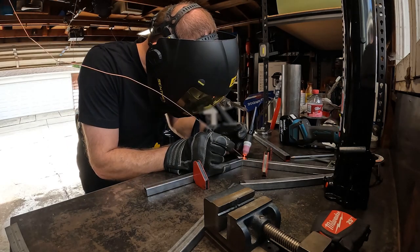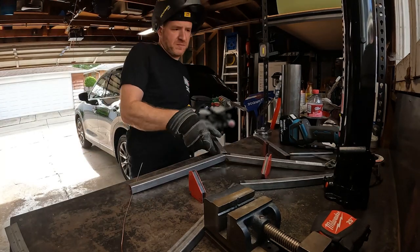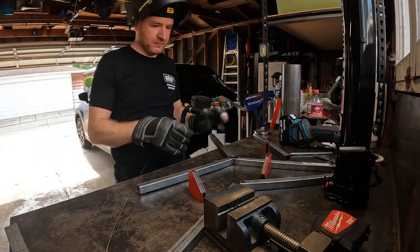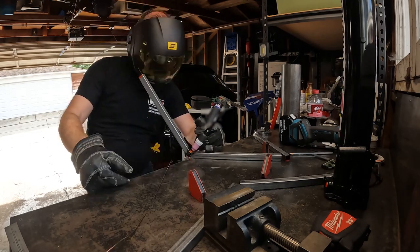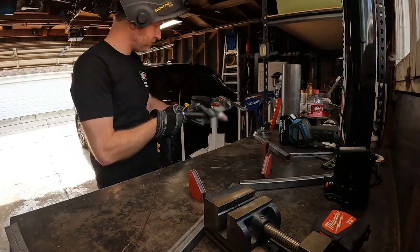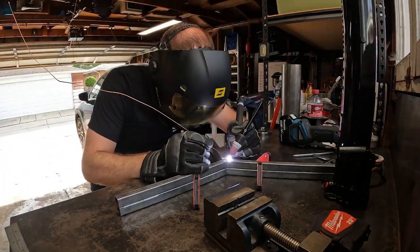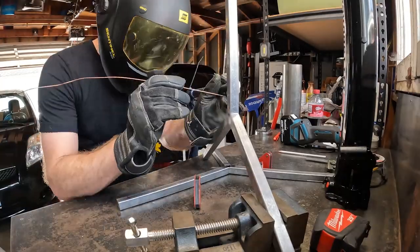The legs are approximately 120 degrees apart and cut from a single three-foot tube for each jack. One foot gets cut off the end; the remaining two are notched halfway in between the ends and then bent to approximately that 120-degree angle. The cutoff is then welded back in — tack the corners, complete the seams. When I feel good about the way it's welded together, I use it as a template for the second jack base. They don't have to be exactly 120 degrees, just the same as each other.